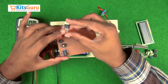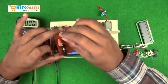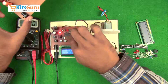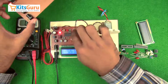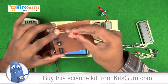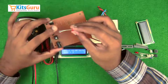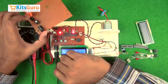The voltage regulator IC: the stem on the left side is the input, then ground, then output on the right side. While inserting, we ensure we are facing the front part of the IC. There are three LEDs: one power indicator LED and two signal indicator LEDs. Along with that, an IR transmitter and receiver are used — similar to an LED, the longer stem is the positive terminal. If both stems are equal length, the LED bulb gets flat on the negative end. We also insert a 1k resistor to protect the LED.